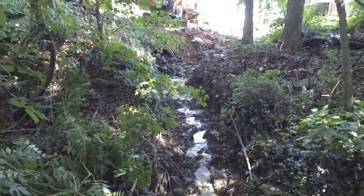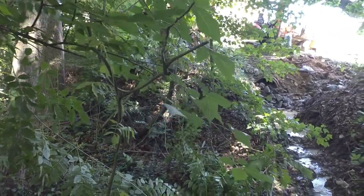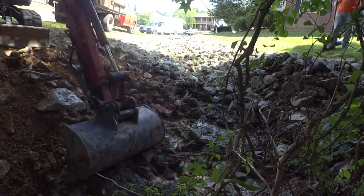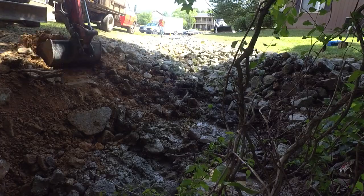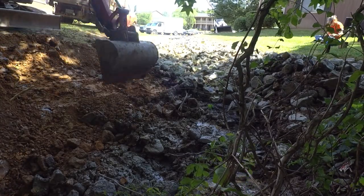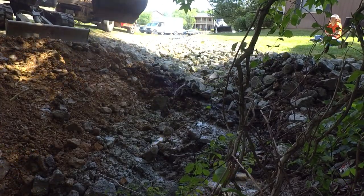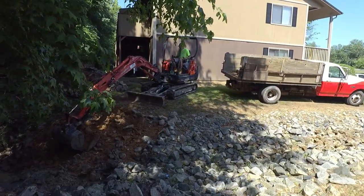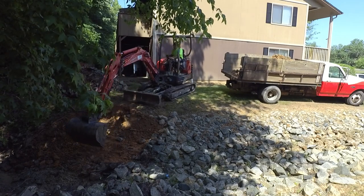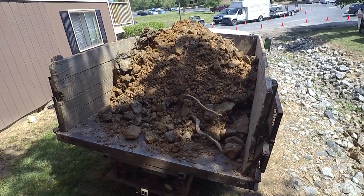I've almost got a feeling that all that riprap is not going to go back in here - that whole pile - unless you want to armor the sides. I don't think we do. As you just saw looking at that creek, we did not put any riprap back in there because that would have just interfered with the flow. In the main part of the swale, we're pulling the riprap out, setting it off to the side, digging out the swale, then putting the riprap back in. That's how we're going to achieve dropping the elevation. Now that we've got the riprap out of the way, I'm going in for the dirt - digging it out and loading it in the back of the dump truck to move it to a different place on the same site.